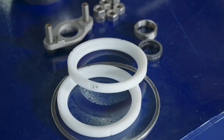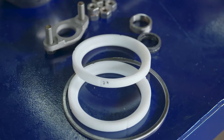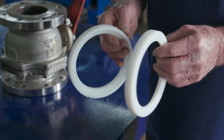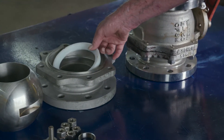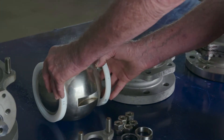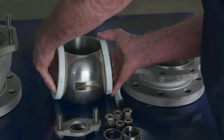We buy the manufacturer's kits. They come in different configurations: stainless, virgin teflon, and reinforced teflon. These are virgin teflon. The way they fit, they fit inside this body in this groove, and when it's put together, basically the way it looks is the ball rotates on these two seats, open and closed.